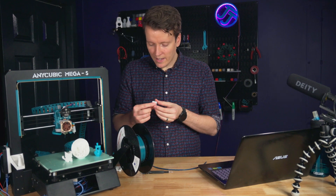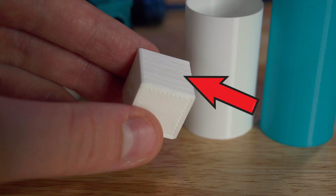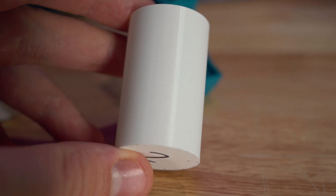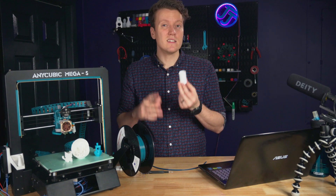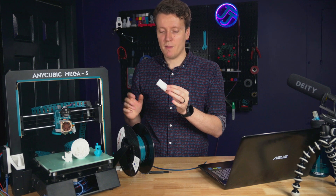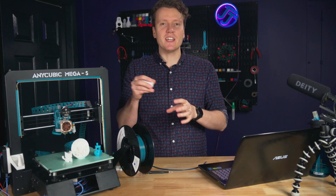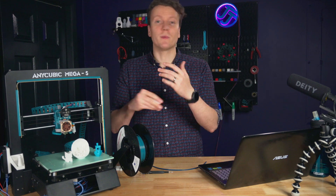After tuning pressure advance, I got a decent looking box, but then I got the dreaded wood grain issue — an irregular graining pattern on the print surface. A great way to expose it quickly is printing a tall cylinder in vase mode: since vase mode has no retractions, you know any inconsistency is the extruder not working well rather than retraction settings.